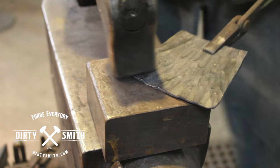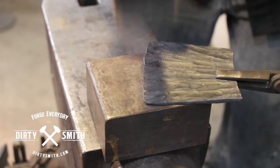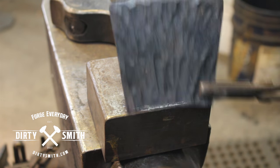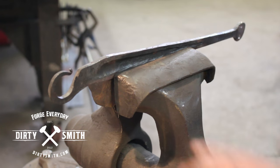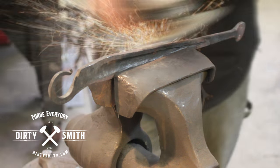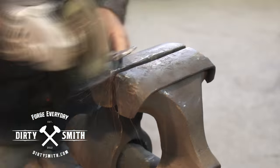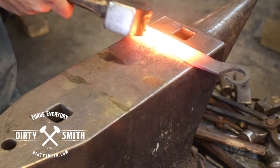Spatula worldwide — I got my pancakes. That's a good pancake. I am going to bevel the edge, because we don't want it tearing up the food since it might ride on those ridges — so we can give it a little lip. Design-wise, we've got a nice radius top, and the bottom has a radius to it as well. One thing I forgot about is the edges — I don't like crisp edges, especially on tools. I'm just going to take a flap disc and knock these corners down. We got the fuller done, got the sides clean, and I'm going to put that fuller side out.